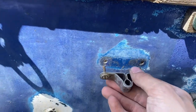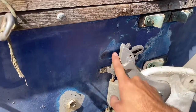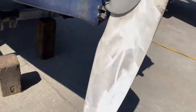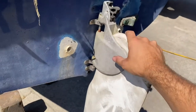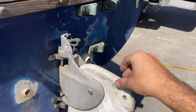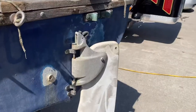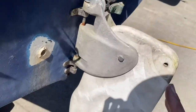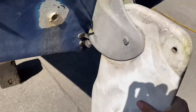We had a little bit of a change of plans. Instead of moving the mount up, we actually moved it down, because I didn't want to lose a big chunk of my rudder — that would defeat the whole point of doing this project. So I moved it down. I've got to modify it so the tiller handle will come up from here and then straight over. Since I did it this way, I can't use the original locking mechanism anymore. What I'll do is drill a hole through so I can put a pin that will lock the rudder in the down position.